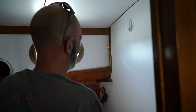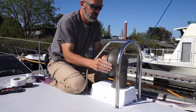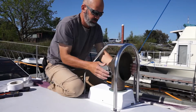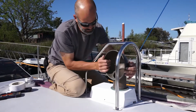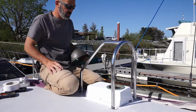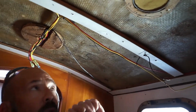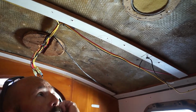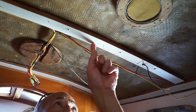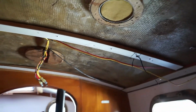Bits of wood. This is how they hide the diesel vent. This is the diesel vent right here. Hopefully this works. So we should still be able to unscrew the cowl vents and remove them. We need to find us some deck plates that pop in here. So 2 of the bolts that come through the forward side of the Dorade guard ended up right here. So I've got to trim out this piece of strip and make the backing plate fit.